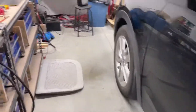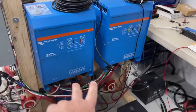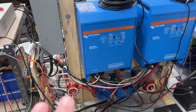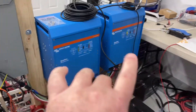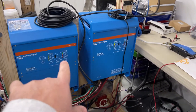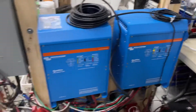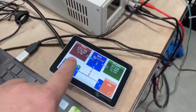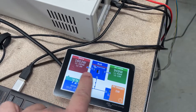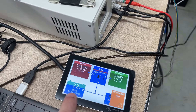This is not how I would actually do it. There are two AC inputs in here, so the generator would be wired into the other input — I will test that at some point. What I wanted to do right away was make sure this would run off the generator. Because it's single phase, what's happening is one Quattro is on inverter and the other one is connected to mains and is currently charging. You can see I'm pulling 1,600 watts off the generator right now.